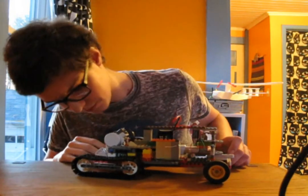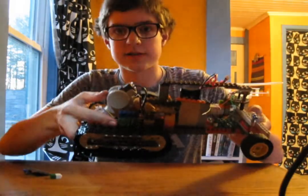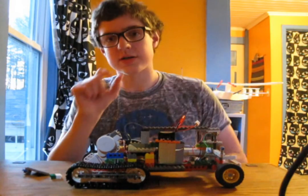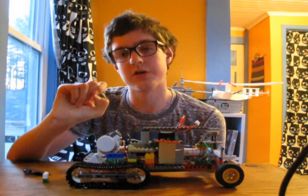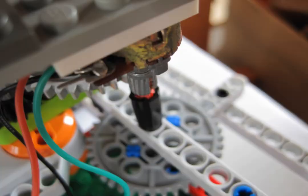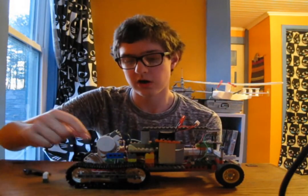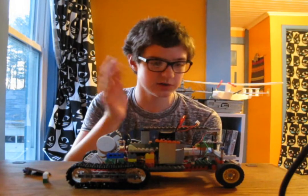Here's how I did that. Right here, that is the control circuitry from a standard-sized servo. That servo has an input from a potentiometer to tell it where the motor is, and an output to the motor to move the motor to where it should be. So I have a potentiometer up here that I've soldered onto wires that run to the potentiometer contacts on here. Then the contacts for the motor are wired into this motor. So it works just like a regular servo, except all the parts are strewn out everywhere.